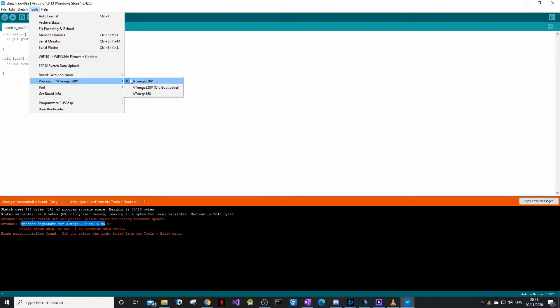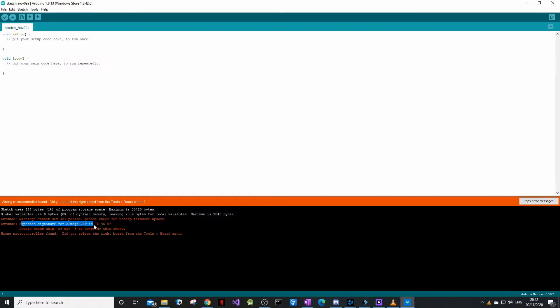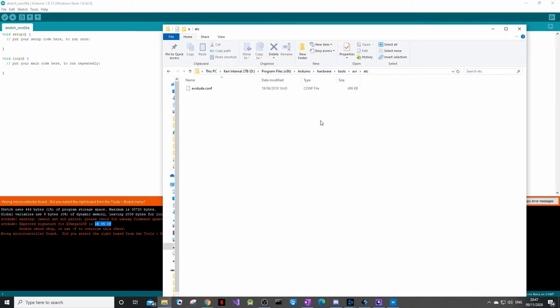When I go to Tools > Processor and choose ATmega 328P, the 328P has a signature of 1E 95 0F. But like I mentioned, I don't have the plain P — I've got the PB. The PB is not listed. The nano and micro options aren't it either. It complains that the signatures don't match — I'm telling it to look for a chip with the P's signature, but it cannot find it. I'm telling my computer to look for the P chip with that signature; it goes through the USBasp via SPI, looks for that signature, gets back and says it doesn't have it, so it cannot program.